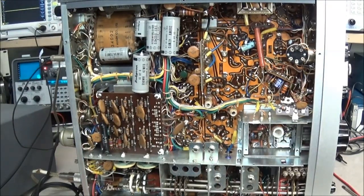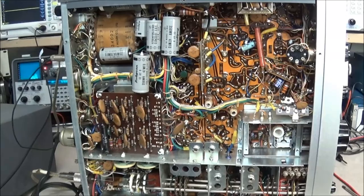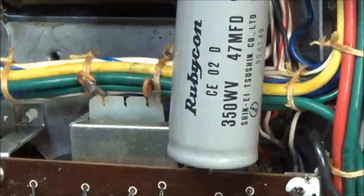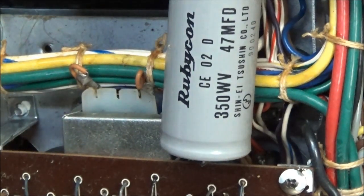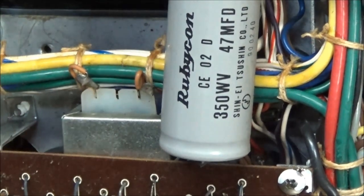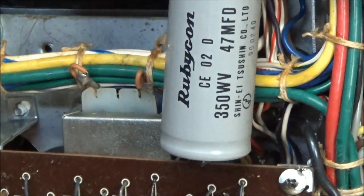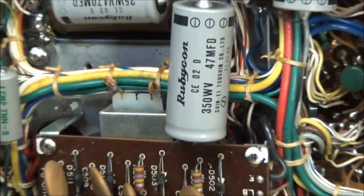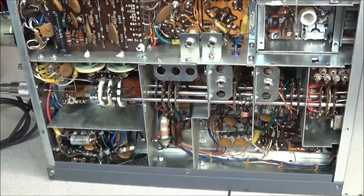I'm not going to test the transmitter at this time. As you can see, we still have a lot of work to do. Before we even start on the transmitter, all these caps are going to have to be replaced. They did use Rubycon capacitors, but I am hearing some hum in the speakers, so that tells me we've probably got some weak caps in here. We may also have some solder joints that need to be freshened up. We need to get all the tubes out and cleaned. Pull the chassis, take the cabinet off, get everything washed up. I'm just amazed at how good it looks underneath — all the metalwork is very shiny.